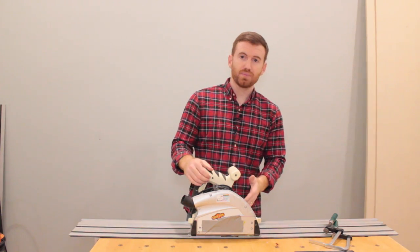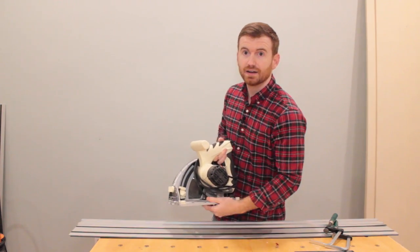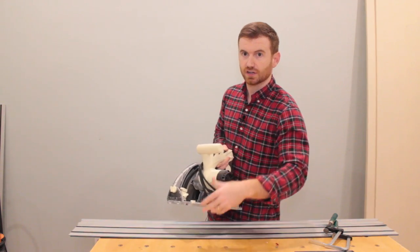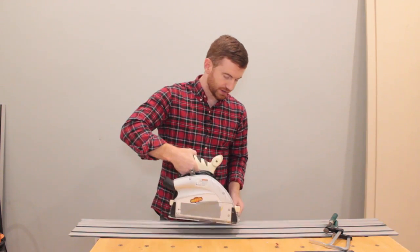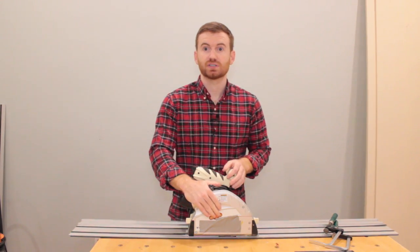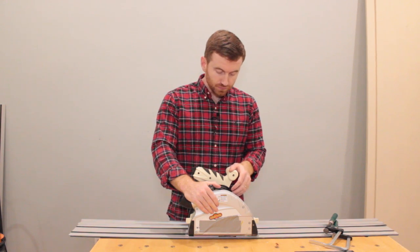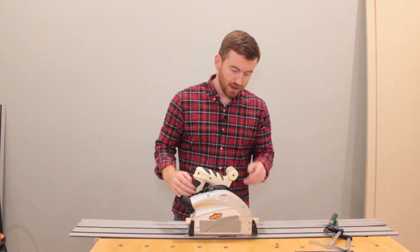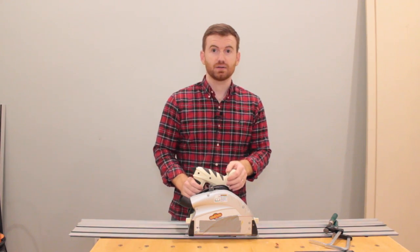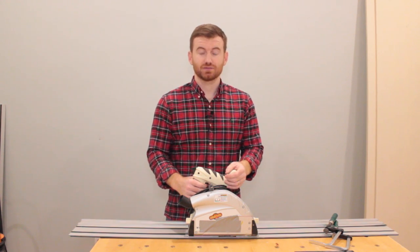It's still going to spit some dust out. One of the main reasons is there's a hole in the back, and that gaping hole means you're losing a lot of suction, so you are going to get some sawdust coming out the front. I will absolutely say if you get this, you need to order a different blade. Don't use the one it comes with — you'll just be wasting your time. I changed the blade right off the bat and the results have been as good as I could ask for.